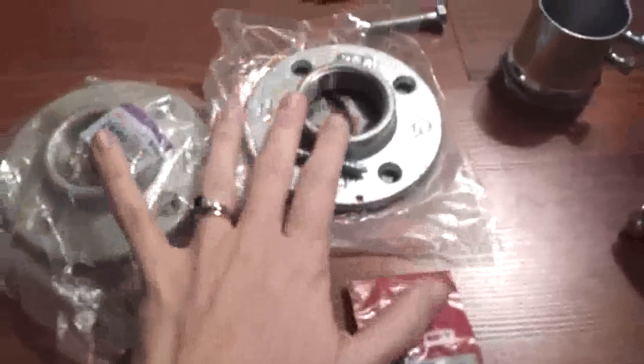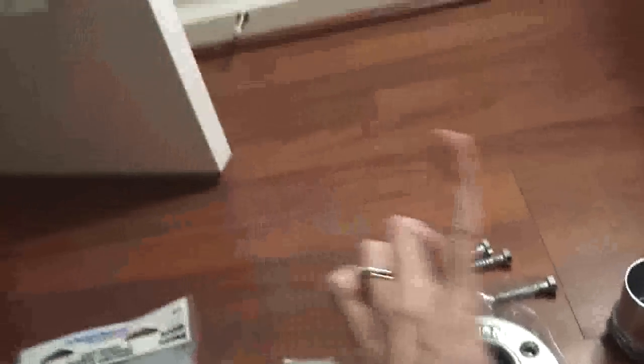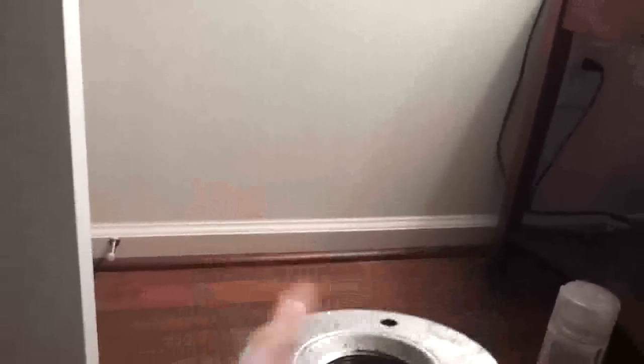You might want to take a piece of the board and actually cut out a piece to put between the ceiling and the flange. Because regardless of how heavy or light you are, you're still going to have the movement of swinging around the pole, and it's going to cause this flange to wobble as you're using it. So if you have a weak ceiling, a wider base across the top is going to help keep you from damaging your ceiling, and it'll be more of a safety thing as well.